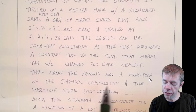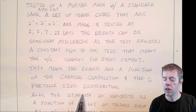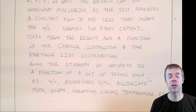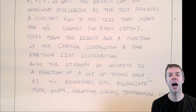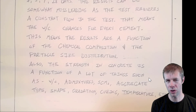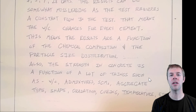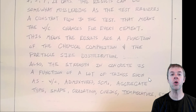This means the results are a function of chemical composition but also particle size distribution. If your cement is finer than someone else's, you're going to need more water to get the same consistency. That means your water-to-cement ratio is going to be higher, meaning your strength won't look as good. But in concrete, it may actually perform better than someone else's because it's finer — and finer is going to give more strength gain, at least early age strength gain, which is what our modern society cares about.